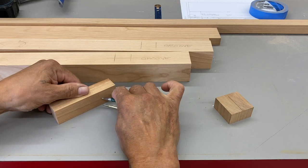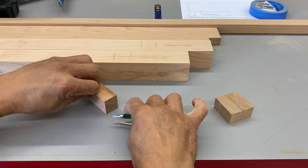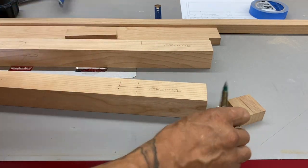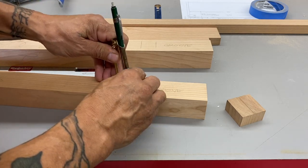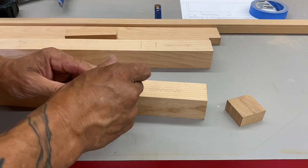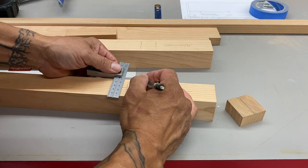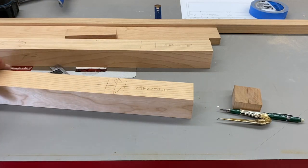Same thing with this one — this will be my rail. I also need a center mark here, because when I go to the pantorouter it works off the center marks, at least for the first ones — you can set stops after that. I'll put a small mark, flip it over. Sometimes I get lucky and it's dead center — just put a mark. So that's my center between those two marks for this direction. I also need center in the other direction, so I utilize a compass: strike an arc just a little bit over half, do that again from the other side, and where those radii intersect is dead center. Boom — that's center. How fantastic is that?